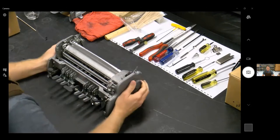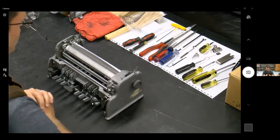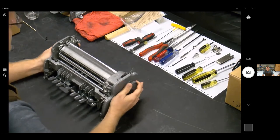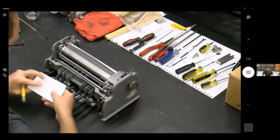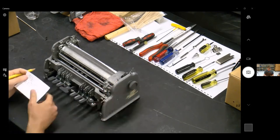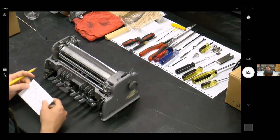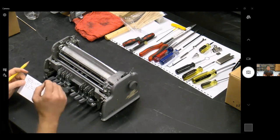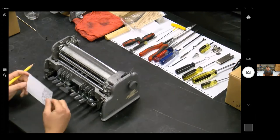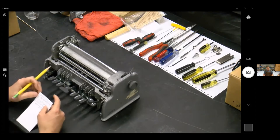Good afternoon. My name is Carl Jacobson, and with me is Tim Puck. We're going to start with the plates off today. To field a couple questions some of you sent in: one was to demo the apron, which we'll cover today. Another was about the two large holes on the bottom of the Brailler when we put the bottom plate on — that's where we adjust pressure on the beam. Also, someone's Brailler flipped over and the paper guide fell out, so we'll talk about that as well.